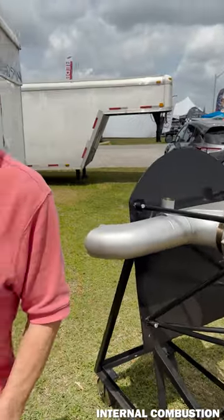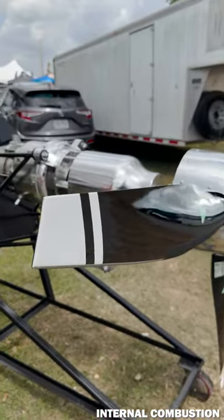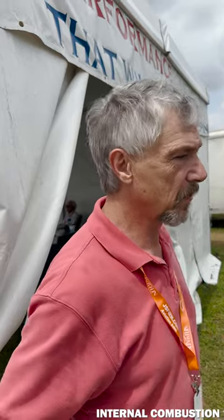That's why when I spun the prop, you saw the turbine spinning. The only drawback is you need to start it in zero pitch. And if you're in zero pitch, that gives you a beta already. So you can use that as a brake or to back away from the fuel pump or whatever.